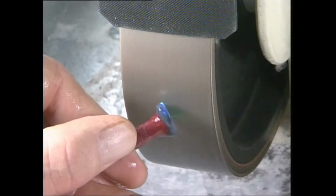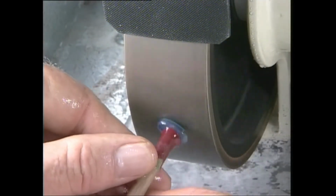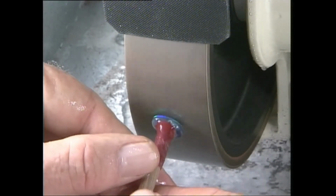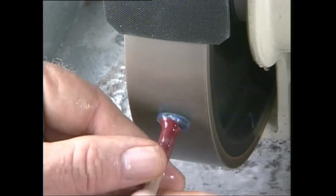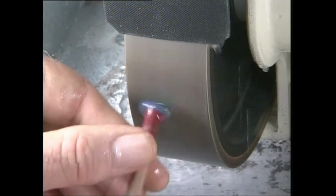We're bringing the opal into its shallow dome now, starting right on the very shoulder itself and working around to the centre. We're cross-hatching the centre there to get rid of any high points before we spin it. It's a very thin bar, we have to work gently here. And we spin from the outside edge right into the centre. We cross-hatch again to get rid of the spiralling created by the previous set of cuts.